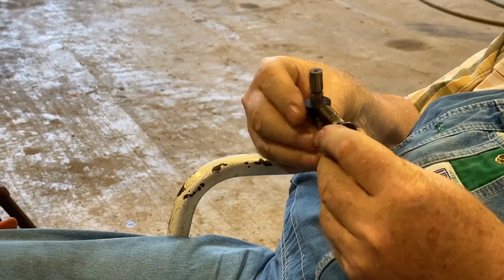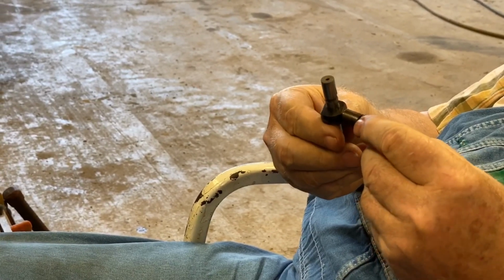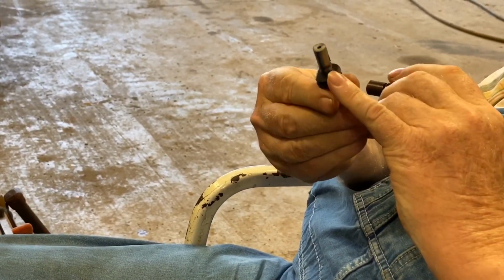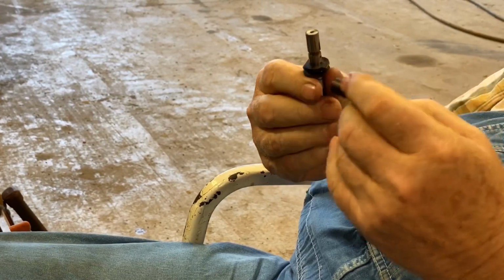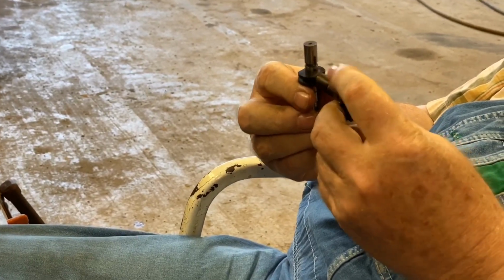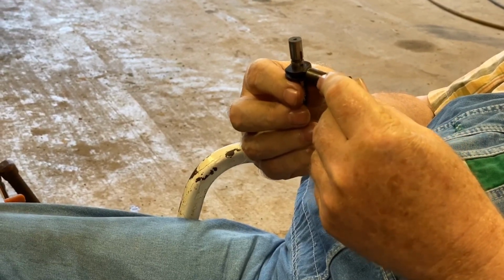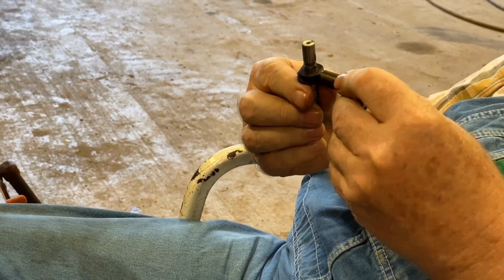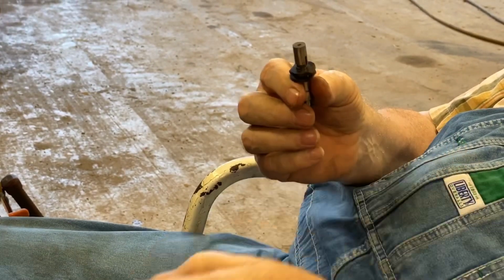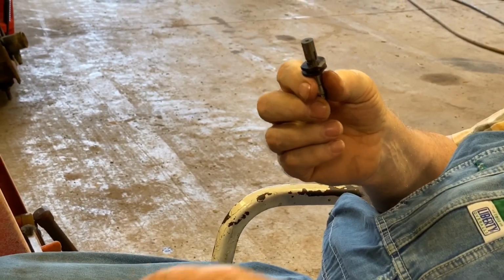So basically what it's doing, this would be something like idle mode here. It's covering this port right here, but this is going up and down. As you advance the throttle, the lever turns counterclockwise and pushes this up, and the fuel can't get out of there. It has to go out through the delivery valve and then out to one of these lines to an injector.